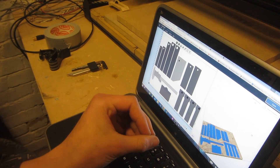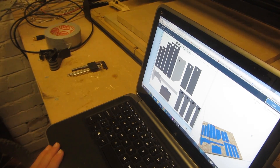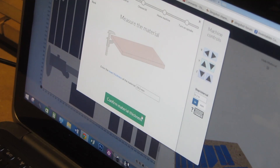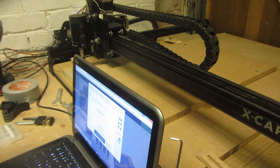I've got my design done and I've checked the toolpath and it looks pretty good — now it's time to try and carve it out with a first attempt. Plug in the USB cable, the carve button on the top right of Easel should light up and you should be able to click it. Then go through all of the different steps which you normally go through in Easel like confirming the home position and making sure everything's secure, and then you'll be ready to carve.